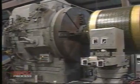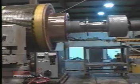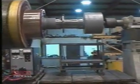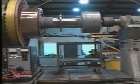In this example, we will be resizing a 2,000 horsepower DC armature shaft. The journal has been machined, removing minimal stock to correct a slight taper condition. In service, the journal will ride on a babbitted bearing.